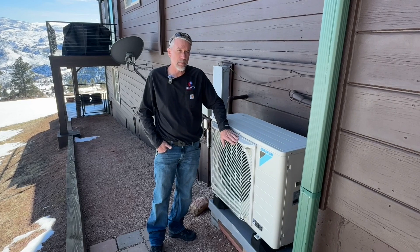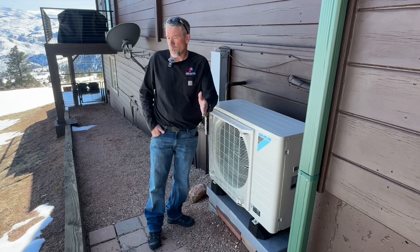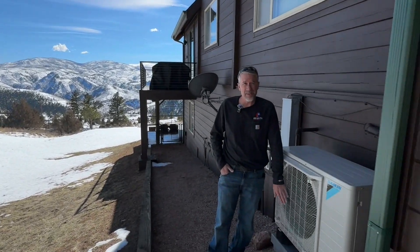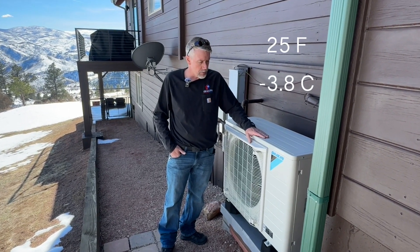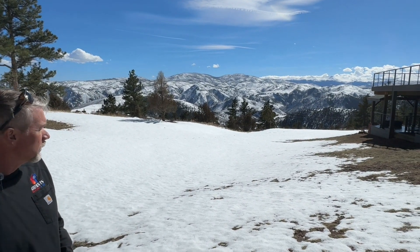Since this is a dual fuel system, we didn't put it up on a mini split stand for the defrost cycle. As you can see, it's winter with lots of snow out here, but there's no ice underneath this unit. With the dual fuel switchover at around 25 degrees, we don't need to lift it way up or add pan heaters. It's a beautiful area — the mountains and the snow are just epic where we get to work. Thanks for watching another video with us — like, share, and subscribe, and we hope to see you on the next one.